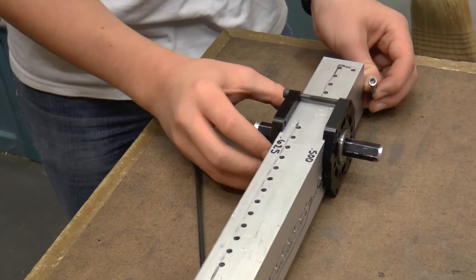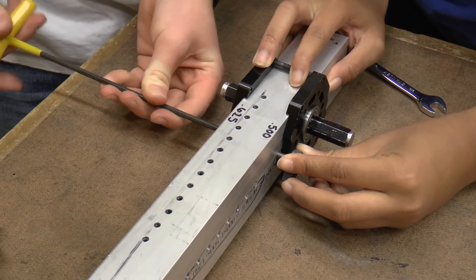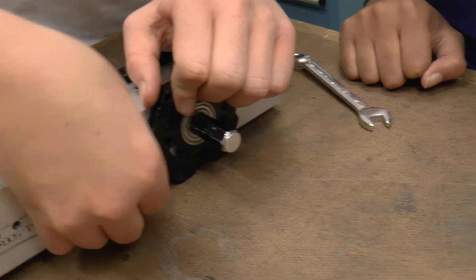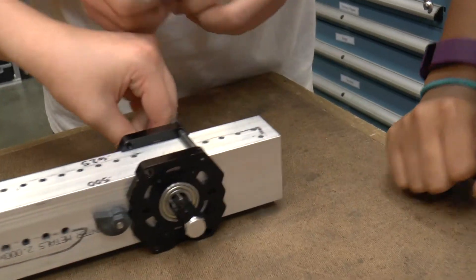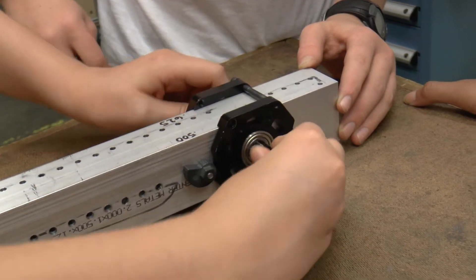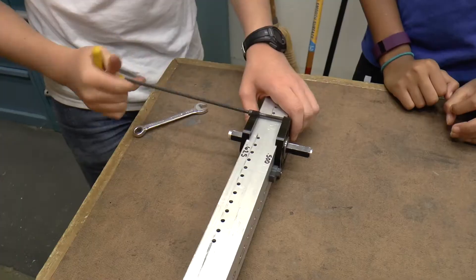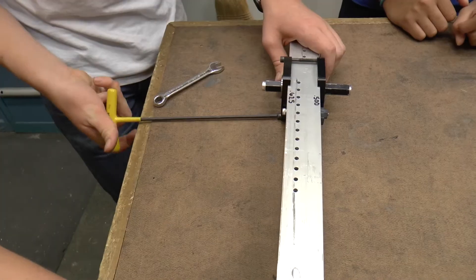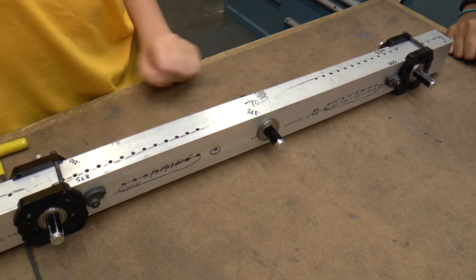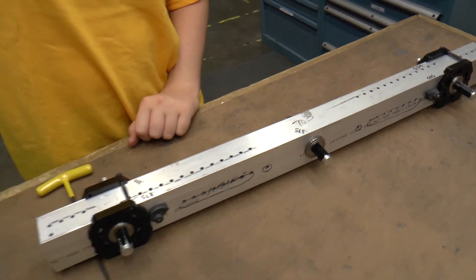Check whether the carriage will still slide a little bit. You want to leave the cam not at its absolute tightest so that when the chain gets loose during competition, you can tension it further and make it tighter. Now we're ready to clamp the blocks. The chains are fully installed, and when we assemble the gearbox and install it, the temporary shaft will get pushed out and the center axle will go into its place. Good job, guys.